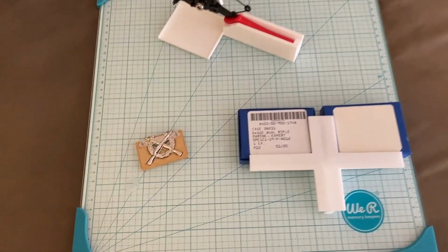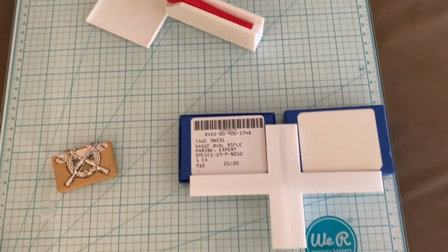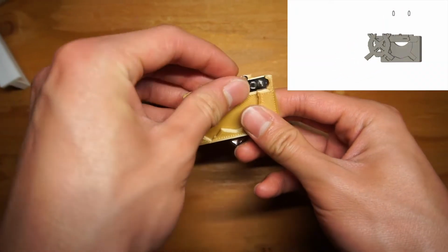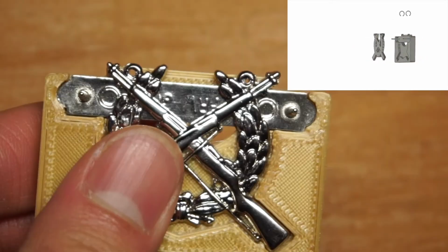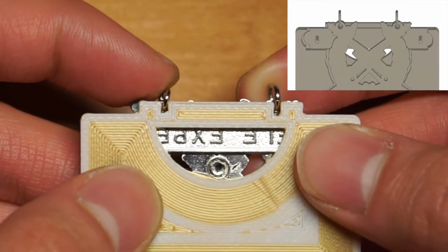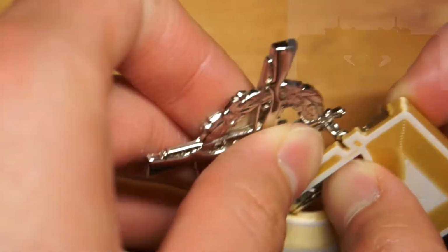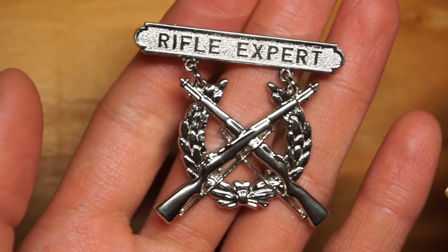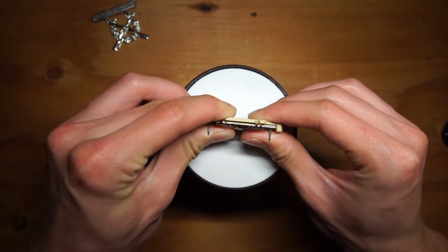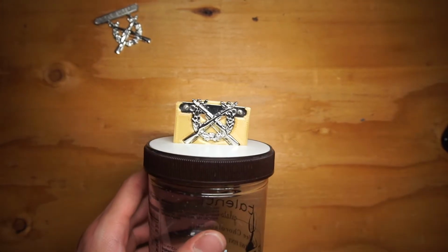Our final designs consisted of 3 devices: a metal alignment jig, an O-ring opener, and a label aligner. The 3D printed metal alignment jig holds the metal pieces in a way that perfectly aligns the clasp holes on the ends of the badge. 2 small indents at the top of the casting serve to stabilize the O-rings during the clamping process. To allow for easy removal, a hole was added so users can push out the finished medallion from behind. An add-on to this cast is a container that can hold the metal aligner upright to help workers who would prefer to keep the mobility of both hands.